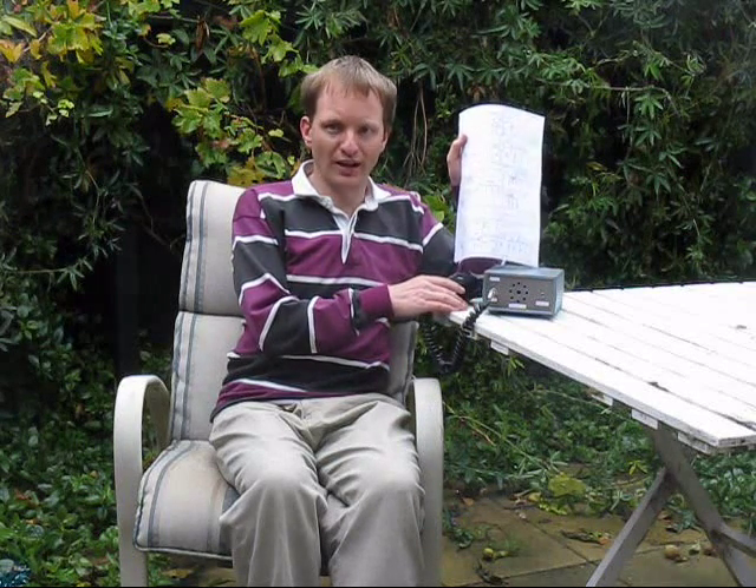The Novelist Wonder: a 7 MHz SSB transceiver that's so simple it can be documented on a single piece of A4 paper. That is the whole schematic diagram. There are just 11 transistors and one IC, yet its 2-watt signal is punchy enough to be heard far and wide. Many successful contacts have been made, and I'll give you a demonstration of those in just a moment.